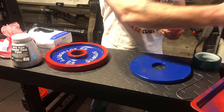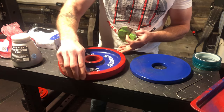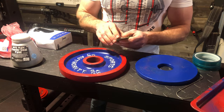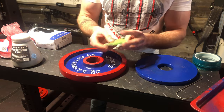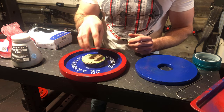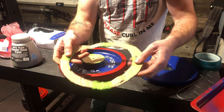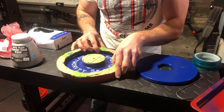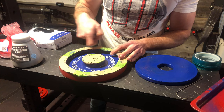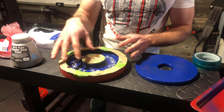The next thing, and this is what I used for doing the two tones here, okay? I had done the blue on the inside first, right? And then I took these guys. It's just a piece of cardboard that I cut out, and then I put two magnets on here so it would stick, right? So once that stuck there, same deal here, four magnets on the outside. Once I did that, I could re-powder coat the inside blue,